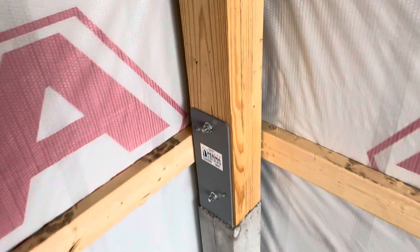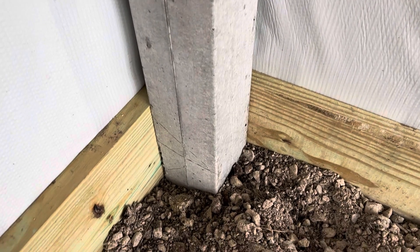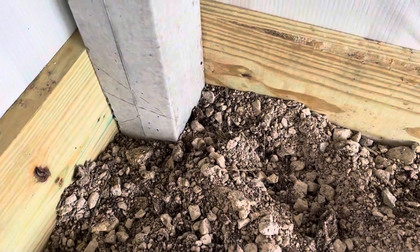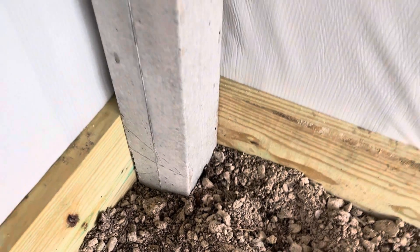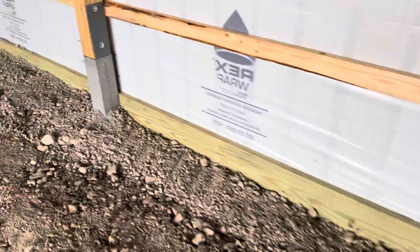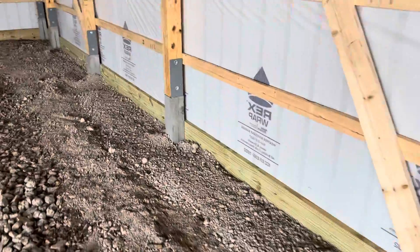You can see right there we've got concrete permacolumns. Here in the state of Ohio, we go down 54 inches. You can see the backfill — four-one stone — and we've got that two-by-10 rim board as well. Concrete permacolumns versus maybe doing a four-by-six, six-by-six, three-ply, four-ply, or something like that — a concrete permacolumn is a nice choice there.